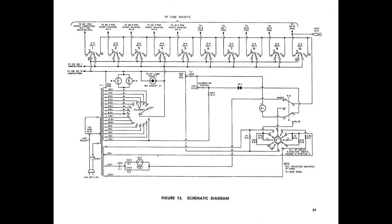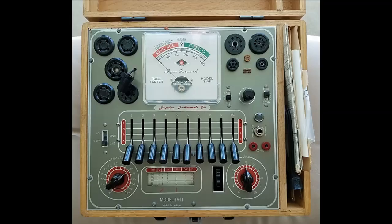And now the Knight is the same. You hear people say, well, they have a TV11, that's better than the Knight. The Superior TV11, the only advantage that it has over the Knight is it has one extra control setting, the one that's labeled N there on the sides, and all that does is totally disconnect whatever internal element is on that pin.